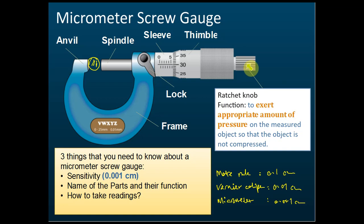When the spindle touches the object, if you exert more pressure by turning the ratchet knob, you will hear a clicking sound — tick tick tick. That sound means the spindle is already touching the object. The ratchet knob pushes back to prevent extra pressure, so we do not compress the object. If you use the thimble directly, you may compress the object and get a smaller reading.